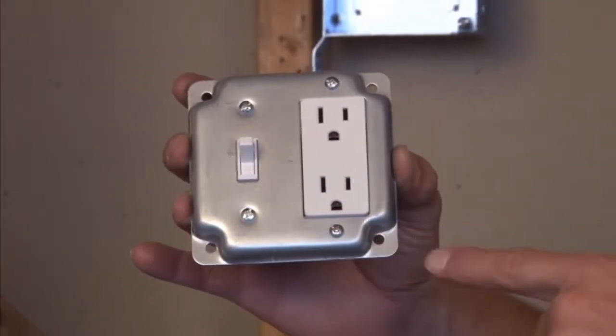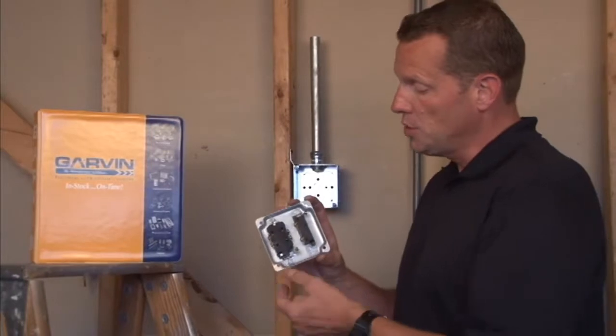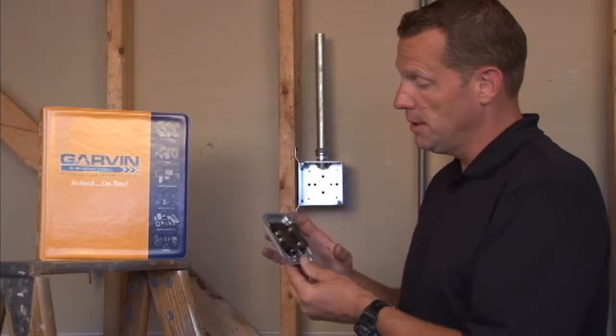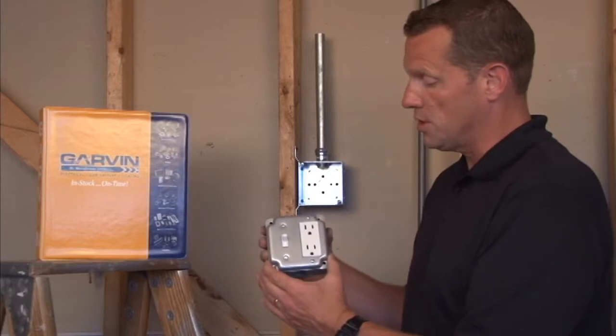As you can see, both of these devices are attached by screws on the front of the cover that mate with the device on the back of the cover, which makes wire installation inside the box quick, safe, and easy. All 4-inch square covers are made with outside holes to fasten securely to a standard 4-inch square box.